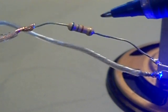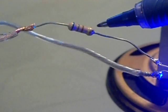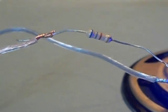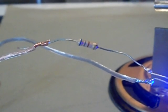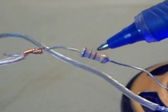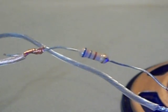Now I could be wrong — that's gold. I think that is gold right there. Gold is 5%. My pen, I don't have a mark on it. That's gold. You're going to find a lot of silver. So these are gold — these are the good ones I bought at Radio Shack a long time ago. So if you can buy an assortment pack, you can buy them on big long strips. You've got to play around with stuff. It goes blue-gray — that's not silver, that is gray. Blue-gray-brown, that is gold. They're the better ones, 5% tolerance. A lot of them you find silver. I'm glad I caught that and corrected that.